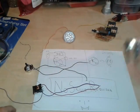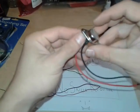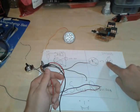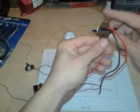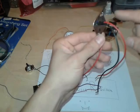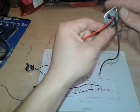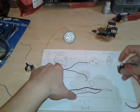For this project we're gonna use the simple transistor 2N3055. We have here a diagram of the transistor — basically this is the way it is represented in circuits, and this is the actual thing. It's got two pins and two holes. If you're gonna look at the transistor from this point you're gonna see the leads — the two leads are not on the exact half of the transistor, it's a little bit up. So basically from left to right we're gonna have base (the red one), emitter, and the chassis is gonna be the collector. So: base, emitter, collector — just like in the diagram.